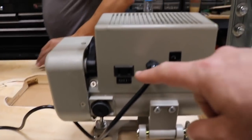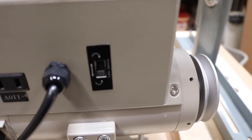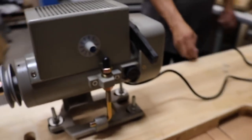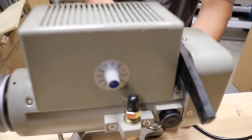One of the most important parts of the motor: in the back you'll see a socket here for 110 volts — that's for the LED lamp. There is also a direction switch: if you turn on the motor and it's going in reverse, just flip this switch. This is a servo motor made by Newtek, 550 watts, 110 volts. This dial here adjusts the speed — it's a silent or quiet servo motor.